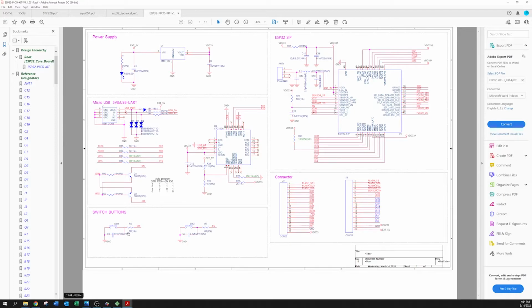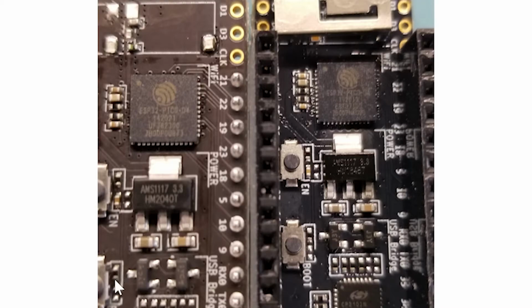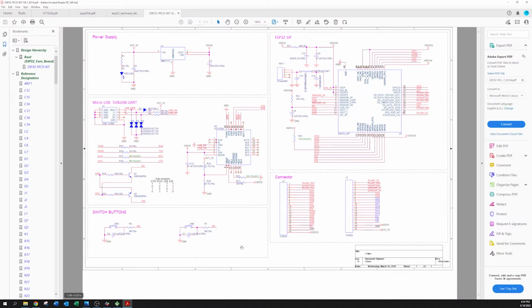And I'm looking at this thing, and so I go back to the picture right here, and you can see here's the little resistor, here's the cap. The cap isn't installed, and I'm kind of curious. I thought it said not installed. I don't know why it doesn't say not connected on this one, but one of the other data sheets says something like not connected. That's another thing about this Espressif stuff. Sometimes there are different versions of the data sheets. You really have to be careful. I just downloaded this thing. I'm surprised it's got an error like that.